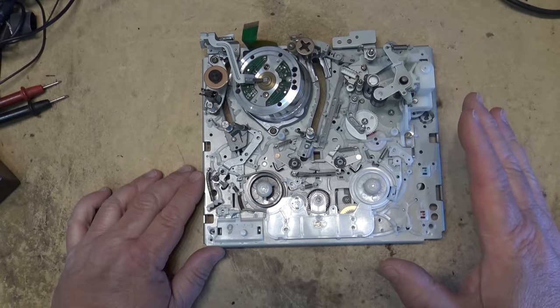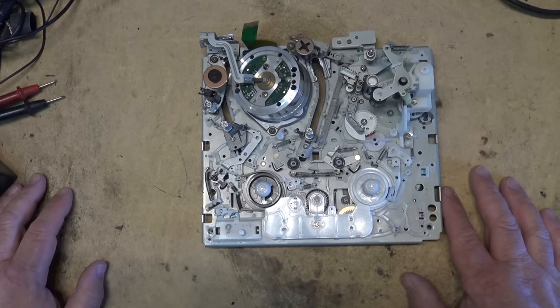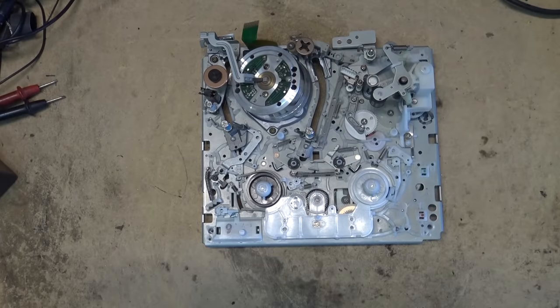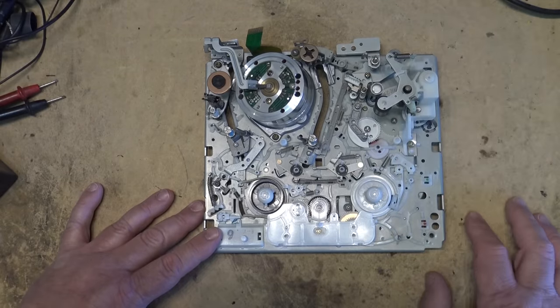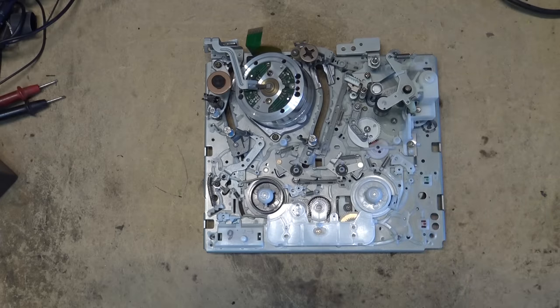What I won't be able to do is the P6 adjustment procedure, because without the rest of the machine to operate it, the owner is going to have to check the height of this guide when he gets it back. If it's set too high or too low, it's going to cause a curl either on the top or the bottom edge of the tape. I'll tell him in an email. I'm going to lubricate this because it's seized up, and I'll also lubricate the capstan post here as well because the grease dries up. Let's get the gear and change it out.